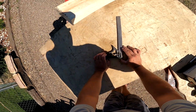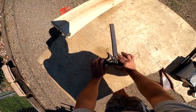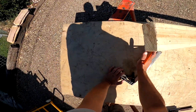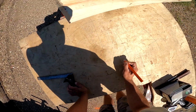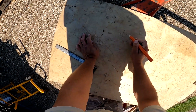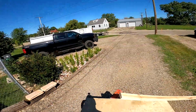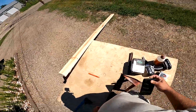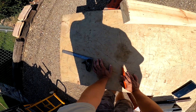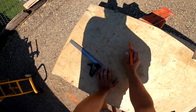We're a little shy — let's divide 90. It'll be slightly more than seven and an eighth for my distance, but we'll make it 90. So 90 divided by 3 is 30 — that means each one of these sections is 30 degrees. These two angles are going to be the same but opposite. If that's 30, they need to equal 180, so 180 minus 30 is 150, divided by 2 is 75. So if we go 75, 75, and 30, we get 180.